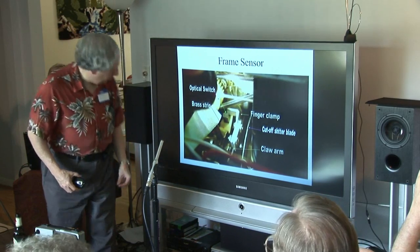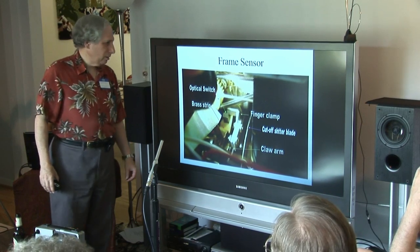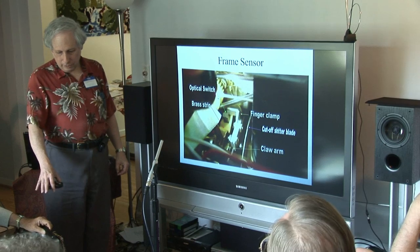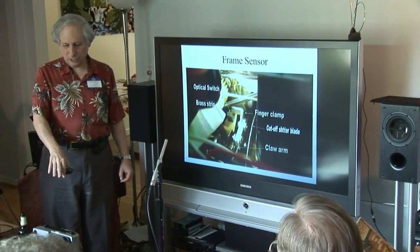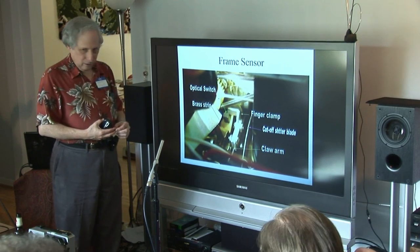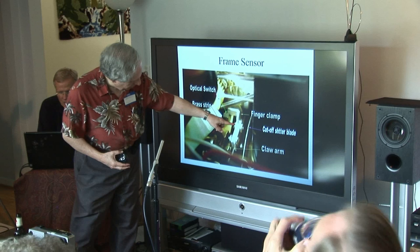The modification on the claw mechanism — I built this about a year ago, with the latest version started about two years ago. This is my new in-the-box projector, so I didn't want to do anything non-reversible on it. I have an older one in the other room that I didn't mind experimenting on, and when I had to do something non-reversible I went and did the other one after I improved the design. To get that trigger switch to work, this is the rocker arm from the claw going up and down and in and out, and I built a little clamp-on thing with a finger on there to mimic the action of the claw.